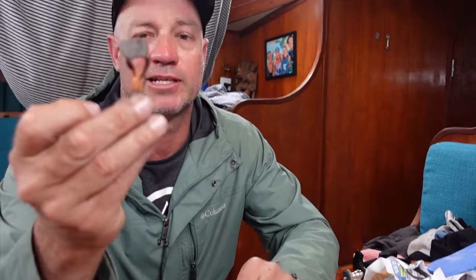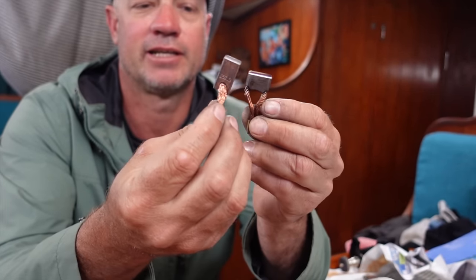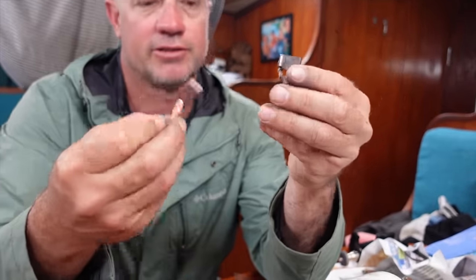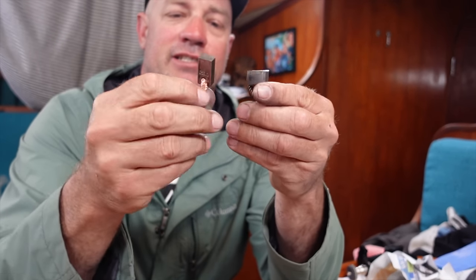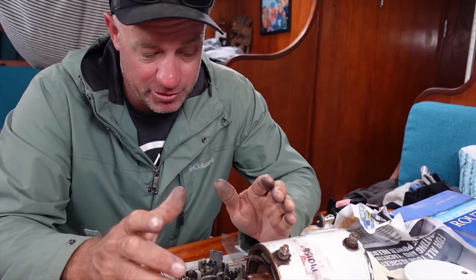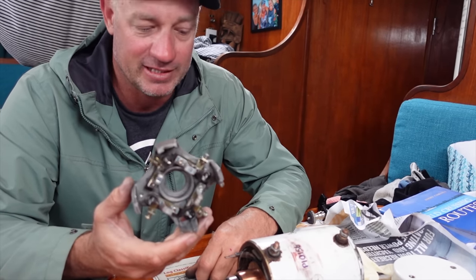I checked it at another marine store too, and I checked it myself online. We all came up with this number for our windlass brushes. These are our old ones — very worn down. And these are the new ones — quite a lot narrower. The wire that comes out the side fails on the new ones too, whereas the wires come out the tail end on the old ones. These must be for a more modern motor. They've probably discontinued this motor. These are pretty much just starter motors — windlass motors. I've got to find some brushes for this somehow.